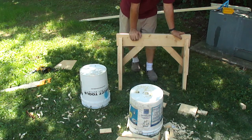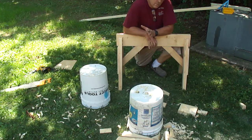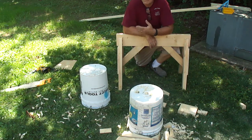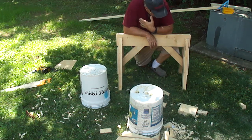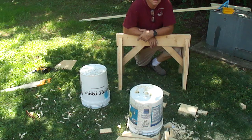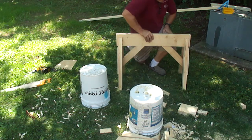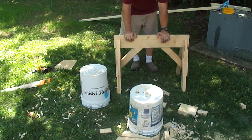You do want to pick the lumber good. If you're going to buy some eight-footers, eights aren't usually as good as 16s because of the kind of tree they came from. So pick out really good eight-footers — little straight and clean and pretty ones with the least knots you can find. Buy an extra; something always warps in the sun. I'll make some other styles — a plywood style I've used and know is a good horse, and a third style I haven't used all my life but I'm impressed with. I like the tradition of it and the joinery of it. A very lightweight sawhorse — you can pick these up and go real fast. They're just good horses, but I purposely made these low for hand tool work. Thanks for watching.